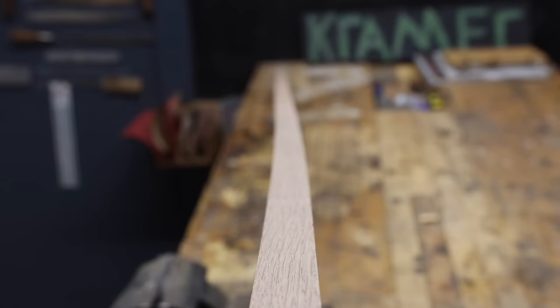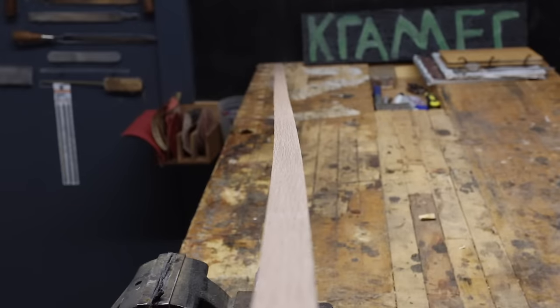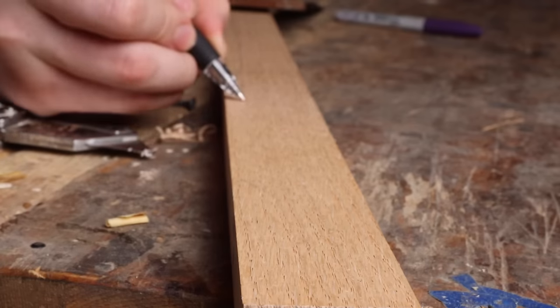The goal with this is to find a piece of wood that has grain that runs all the way down the piece of wood. You do not want grain to run off any side of the piece of wood — if grain runs off the wood, this could lead to a broken bow. Wood grain is very important and is often overlooked.